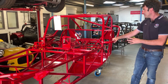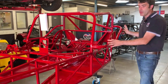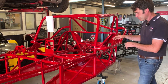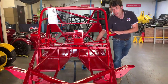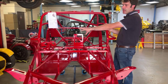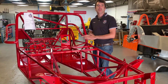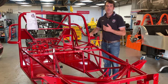This one is the MSA. It's got sidebars on each side, which we can do as an option — we've got approval with or without, depending on what you're racing. If it's more sprinting, you'd probably leave it; if it's wheel-to-wheel, I'd personally put one on at least the driver's side. This one has the standard steel floor, welded in, and we've gone with the lowered floor since he'll mainly be on the road, keeping seat runners. It's got the standard Mazda pedal box setup, and this one is based around Mazda running gear, although all Gen 2 chassis are now universal in the engine bay — so you can run Mazda, Ford, or Gerotech engines, giving you lots of flexibility.